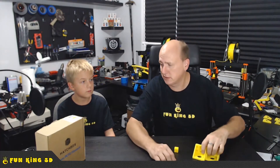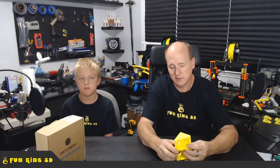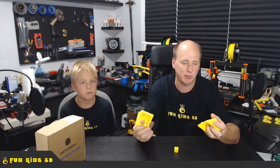It did take a little bit of dialing in as far as temperature. We ended up at 245 degrees on the hot end and 50 degrees on the bed. I started at 90, which was Prusa's default, and I didn't like the way it was rippling, so I'm down to 50 degrees and I think I like it. Hats off to you Hatch Box — like your stuff, keep it up, make more so I don't have to wait for it to be in stock.